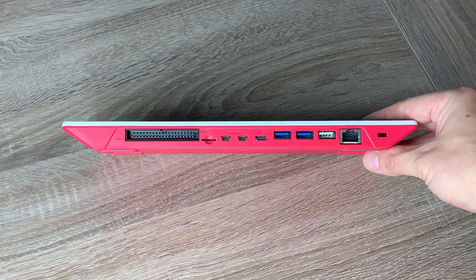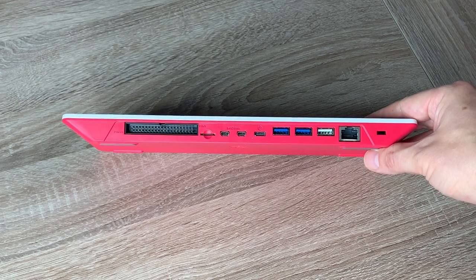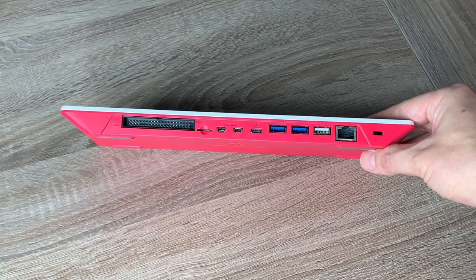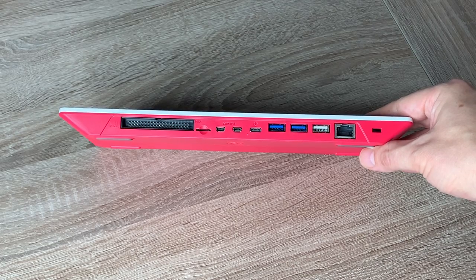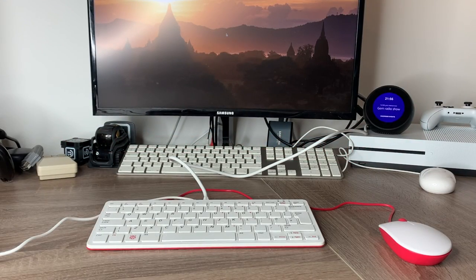On the back of the Raspberry Pi 400, there's actually quite a generous amount of IO ports. I love the fact that the GPIO port is now like a proper plug-in connector - it looks a bit like an IDE connector. In the past I've had serial cables and stuff plugged in on my Raspberry Pis that meant leaving the top of the case off with little wires traipsing out the side. So it's nice to have a proper dedicated port for the GPIO pins on the back. Next to that we have the SD card port, a couple of micro HDMI ports - you can run dual screens. We have the USB-C power supply connector, a couple of USB-3 ports and a USB-2 port, and Ethernet as well. It's actually quite generous - I've got machines that are several hundred pounds, if not thousands, that are less generous with their IO ports.